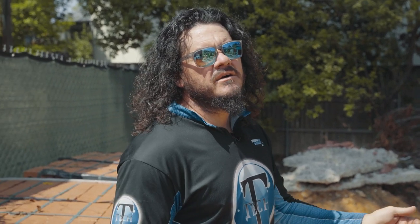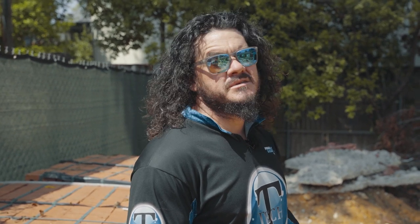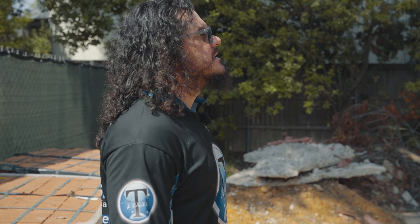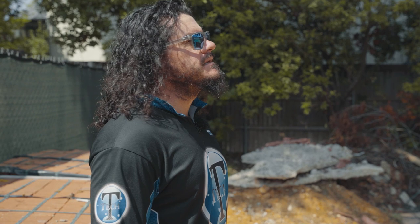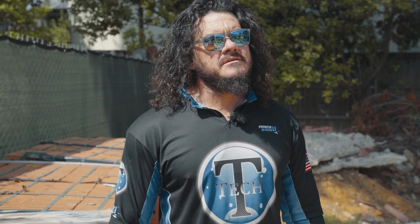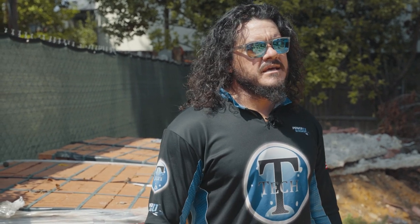I did get one tile as a sample to give me an idea what I'm up against. I put about a five percent mix on that tile and the color change happened within about 30 to 45 seconds, and so that lets me know they're going to clean up pretty well and I shouldn't have to apply any direct pressure to get them cleaned. If they've got a thick layer of growth on there it may change color a little bit but doesn't always wash off thoroughly, so it's a good idea to do a test spot on a Spanish tile if you get the opportunity, so you can price accurately and give a good expectation for the customer.